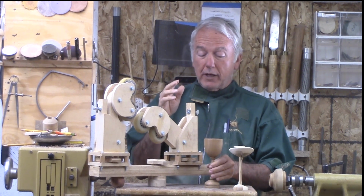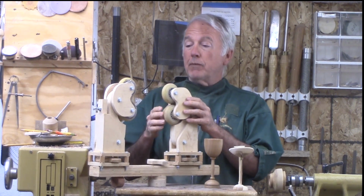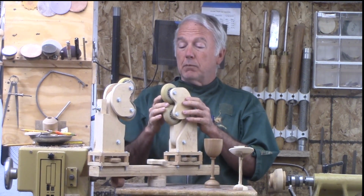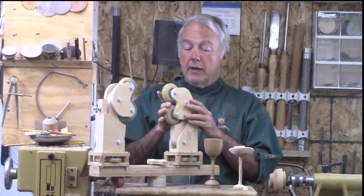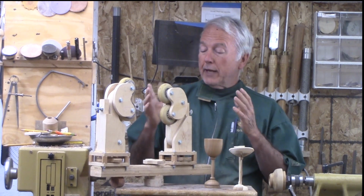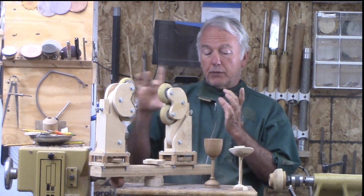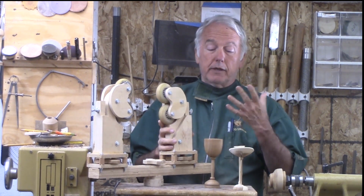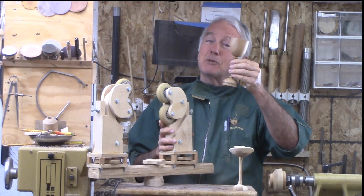But essential to turning a goblet, for me at least, is my steady. This is one that I made several years ago. It has the advantage that I can mount it onto the lathe without having to dismount my turning piece. It keeps good lateral pressure on both sides, both a little bit up and a little bit down. So I do have a video of this in the archives, and I'll reference it also in the description. But for me, anytime I'm well away from the spindle with a thin piece of wood, I really got to use this in order to be able to take the lateral pressure that the lathe will take. So for now, let's go ahead and turn this one with a slightly off sequence of processes.